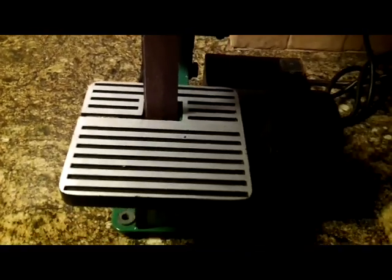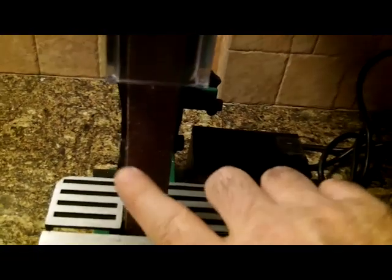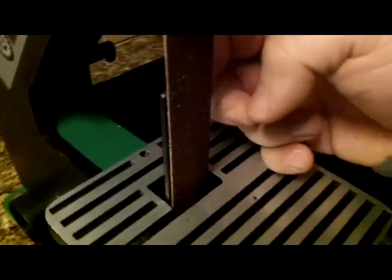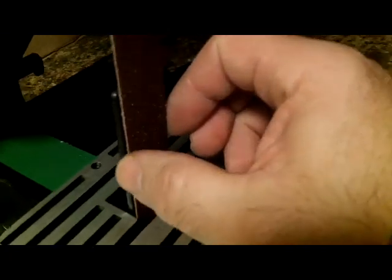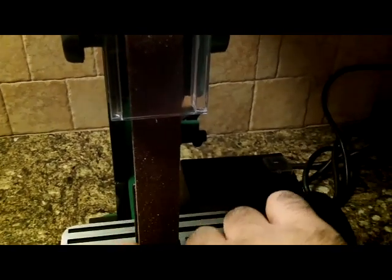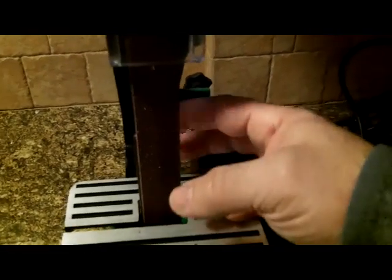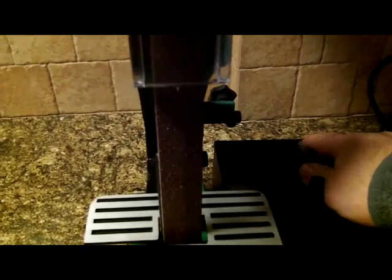Okay, I plugged it in. There's your tracking adjustment screw. If you look at the belt, there's a steel bracket in the back — it sticks out a little bit over to one side. Let me go ahead and turn it on and see what happens. It's a little bit noisy. I'm going to try to move the belt over to cover up that bracket. If not, I'll take it off and file it down — I don't want my knife touching that steel.